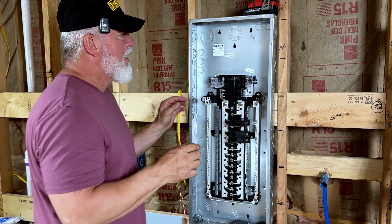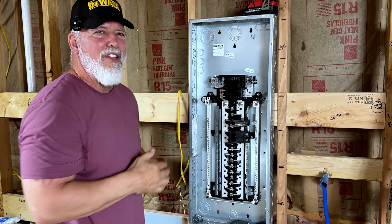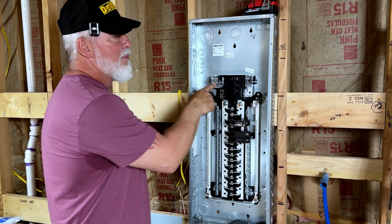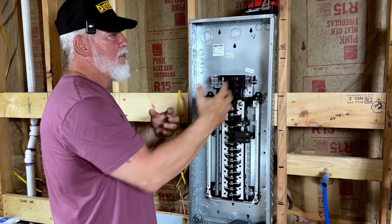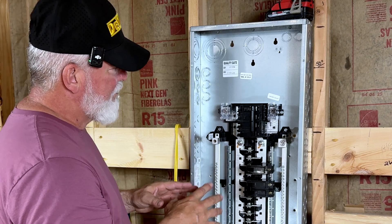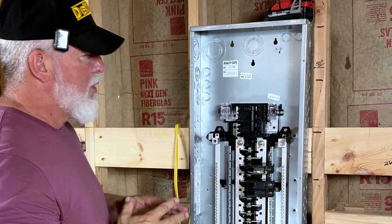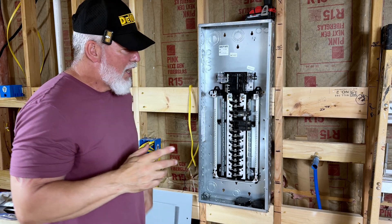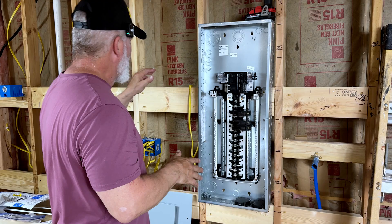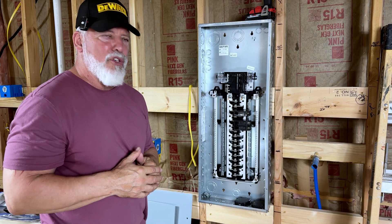Now let's talk safety. If you're going to pull the cover off, flip the power to the off position — that shuts everything down up to those points so they are protected, and when you pull the box off you're safe. You're not going to touch something that will shock you. When working in here, stay below the main wires area, watch those big wires, and do not ever touch them. I generally keep one hand in my pocket while working, because power can go through your hand, through your heart, and if you're touching something else metal it will try to go to that — you become the conductor. Be cautious.